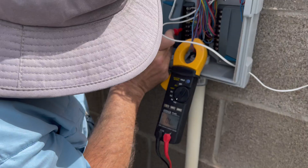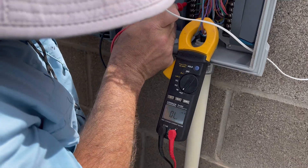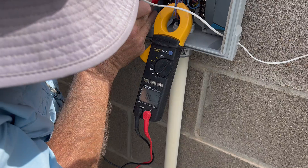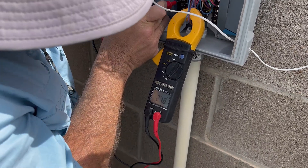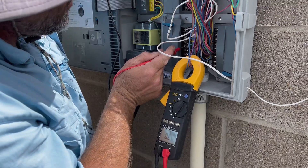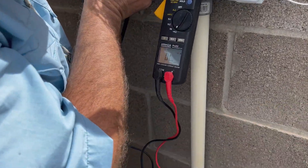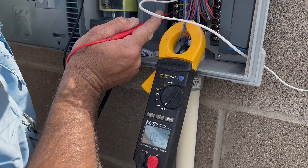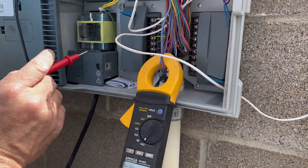This one's not doing anything. So number 11 is good, 12 does nothing, 13 is good. Number 12 is not showing anything — we've got a problem. Walking around, I never saw where number 12 was, and it may be because that solenoid is bad.